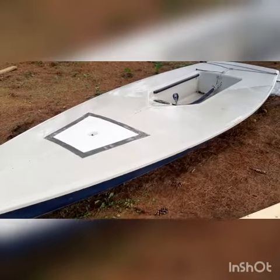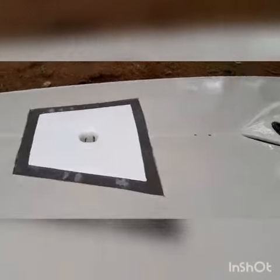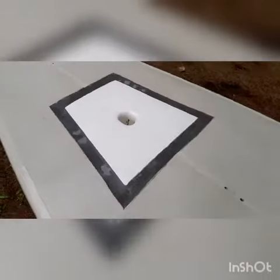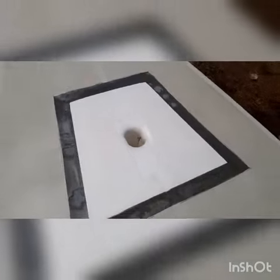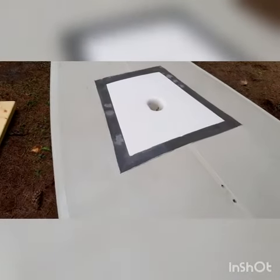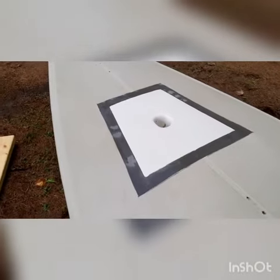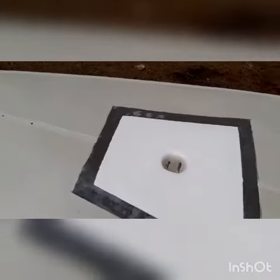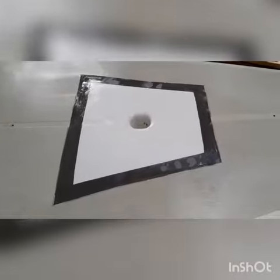So here we are, coming up on the last step. I've put the manufactured deck mast tube down into the new mast step — screwed it, unscrewed it, fiberglassed it. It's good and solid; I can stand on that now. And that is the polyester resin, the dark stuff around it. I put a couple of coats of that on until it's mostly smooth.